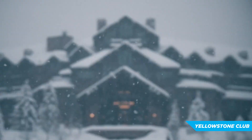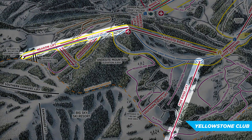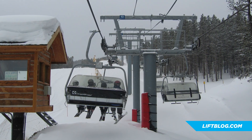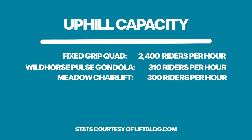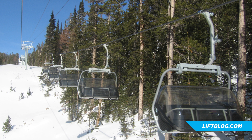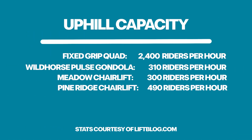The Yellowstone Club is home to two pulse lifts: Meadow and Pine Ridge. They are both located on the ski area's eastern side, which mostly serves as a transportation zone — either getting into Big Sky, coming back from Big Sky, or to access Yellowstone Club homes along these trails. The Meadow lift has four total groupings of three quad chairs, giving it just 12 chairs on the entire lift line. Its long length of over 6,000 feet gives it a super low uphill capacity of just 300 riders per hour. The Pine Ridge chairlift has four pulses of five chairs each, and due to its shorter length its capacity increases to 490 riders per hour — about 20% of a standard fixed grip, making this a hard sell for operators outside of transportation purposes.